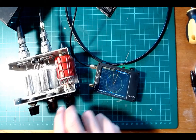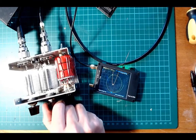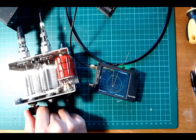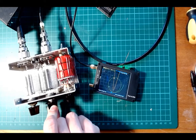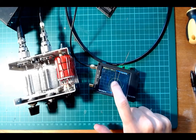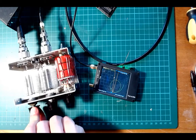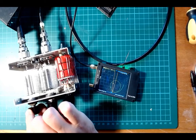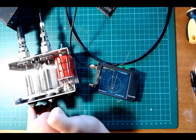The goal is not just to look at the SWR — the goal is to move the complex impedance on the Smith chart toward the center, which is precisely 50 ohms. The SWR is just a consequence of reaching the center. Playing with this capacitor in one direction enlarges the circle and moves the green dot clockwise. The other capacitor also moves things clockwise without dramatically changing the circle size.